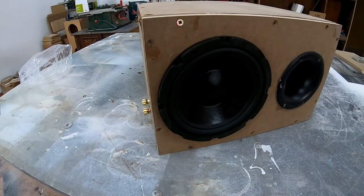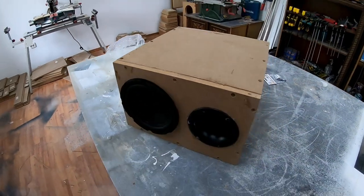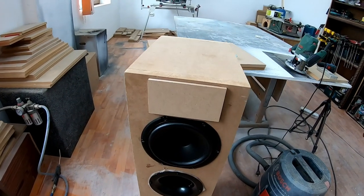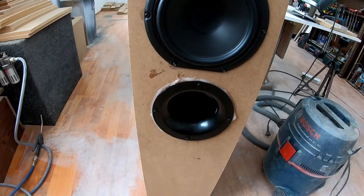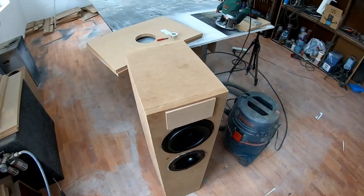So here's the plan. We have two enclosures to play with. A subwoofer — this uses a Dayton Audio 8-inch driver and the port is 70 millimeters in diameter. It doesn't matter how it's tuned because we are going to compare the results between them and we are not interested in the performance. And because I suspect that the results from the subwoofer won't be that spectacular, I'm going to do some tests on a floor standing speaker. This is the test box from the cheap floor standing speaker project from a while back. I basically covered up the tweeter hole and now it's good to go.